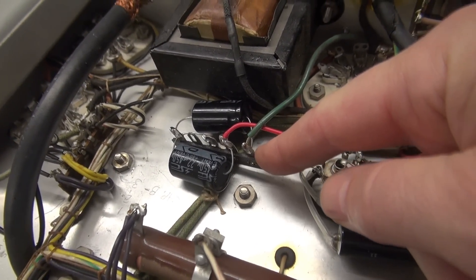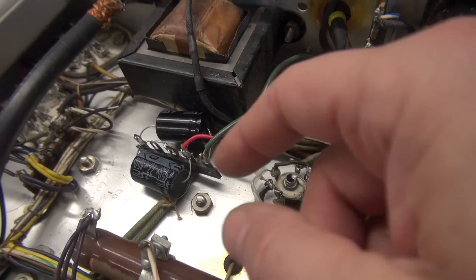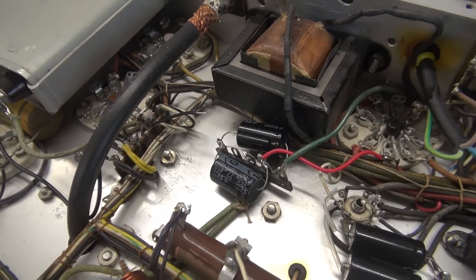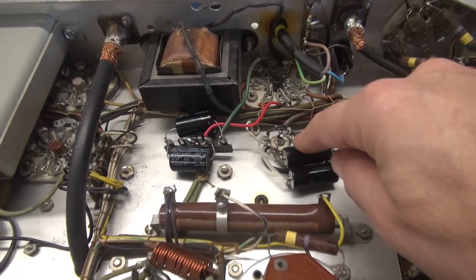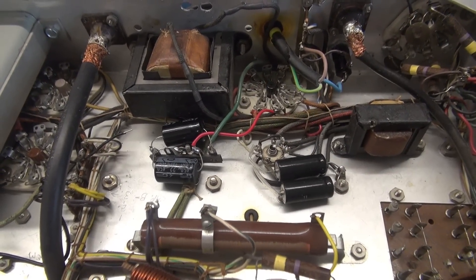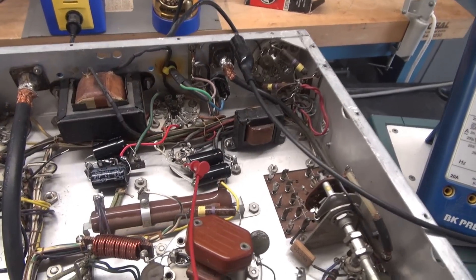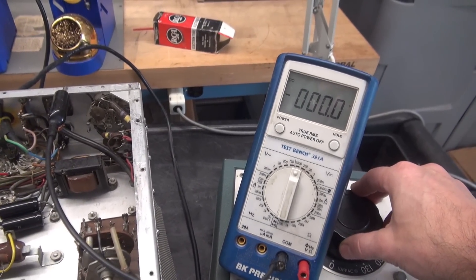All the caps are installed — there are the new low voltage 450-volt units. I went ahead and put in another terminal board to make the installation neater. I had to replace a red wire because it was too short. The other wire appears to be just a ground runner that went to some original filter caps that a previous owner had removed, so I'm not going to worry about that right now. This thing is ready to test. I'm going to check the voltages first, especially that critical negative bias voltage, then we'll try to transmit.